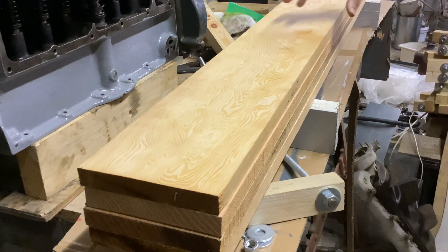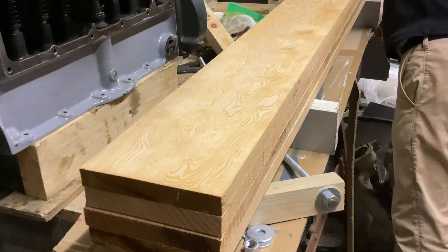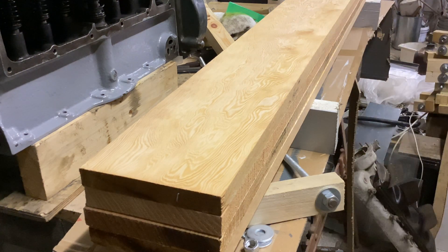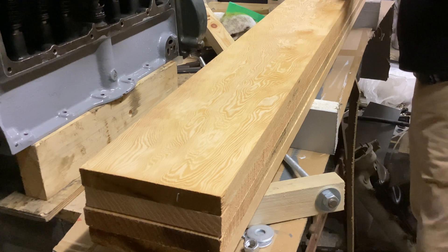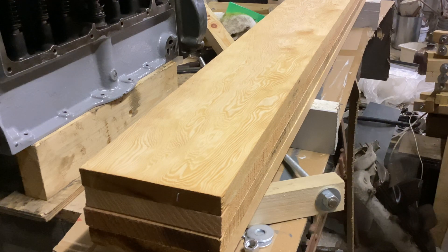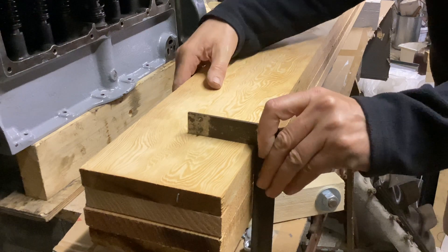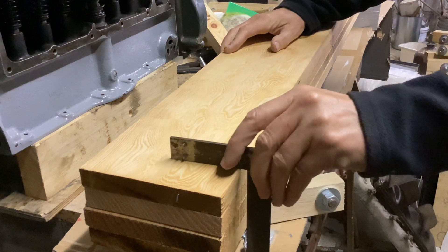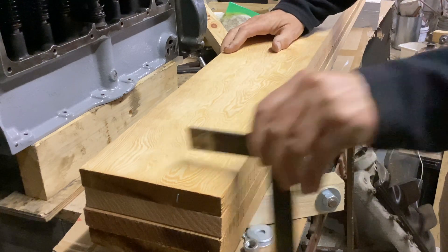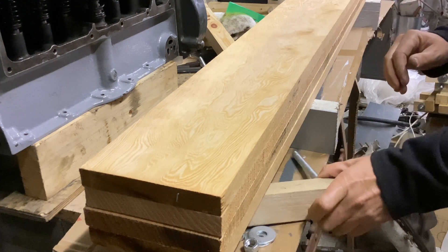The main thing at the moment is just to get the thing nice and square. I need to get it square because I don't have a lot of width to play with with that blade profile on top - these planks are six inches, about 150 mil. I did that for two reasons: one, they weren't as expensive; when I made the other propeller I used eight inch wide planks because the hub was six and a half inches wide, but there was quite a lot of waste. Also the blank weighed a tonne - when you see people making First World War propellers like Elena at Culver Propellers lugging those great blanks around, she must be a tough girl. At least using six inch wide planks keeps the weight down for manhandling it through the bandsaw. That's all lined up so the clamps can go on.